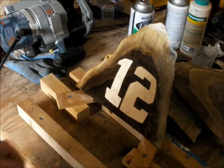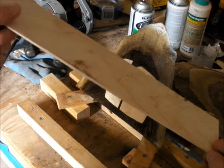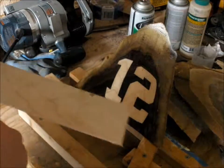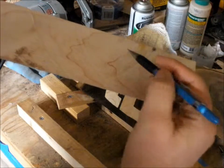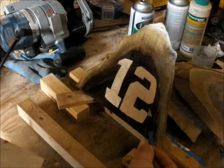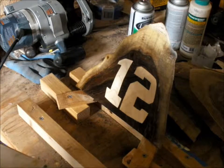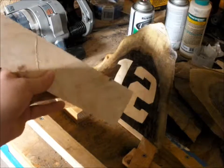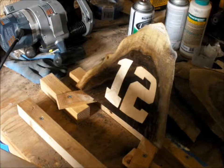Regarding the bandsaw angle: when drawing out the pattern you'll want the top side facing out. When the bottom of the inlay piece is just a little bit narrower, the pattern you're transferring to the work piece is just a little bit smaller than what it actually needs to be — and that's perfect. You'll end up having to fine tune the fit of the inlay piece into the pocket, and you'll need to do a little sanding to get it in there.